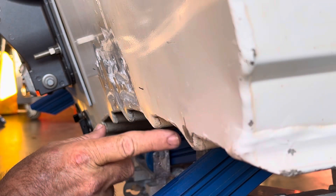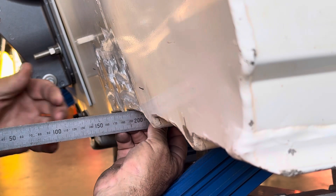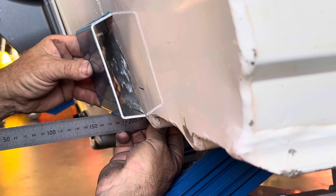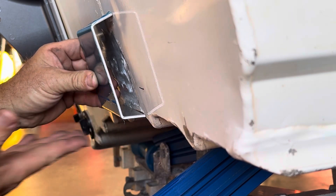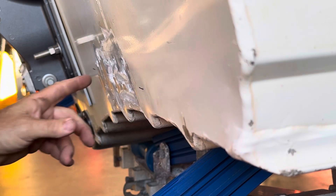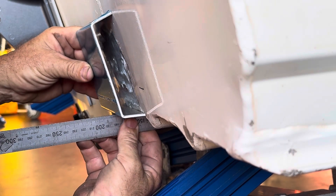Look at the shape of the back of this boat — it's all curved, a beautiful shape. What you want to do is make your transducer bracket flush with the bottom of your hull, so you get the minimal amount of disturbance off the bottom of the boat to your transducer. We're going to fill in all of these holes and get the least amount of interference.